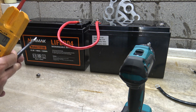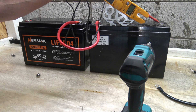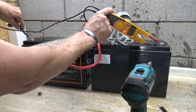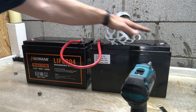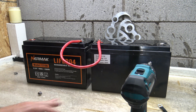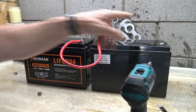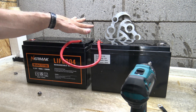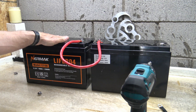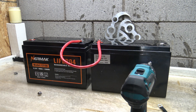The voltmeter reads 27 volts. We doubled our voltage, so we have basically a 24 volt battery — one big battery at 24 volts and 100 amp hours. When we plug in our inverter, the positive from battery one and the negative from battery two go to a 24 volt power inverter. We would not want to take the positive and negative from just one battery — again, that would cycle that battery much more and wear it out faster. That's why we split the load between the two batteries in this bank.